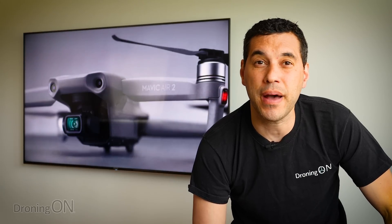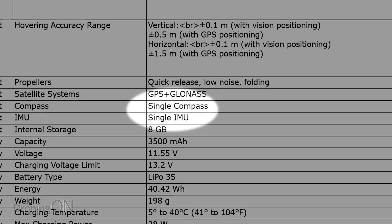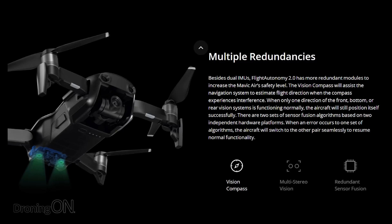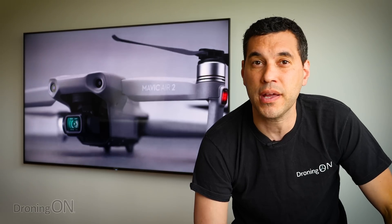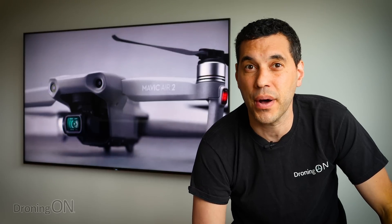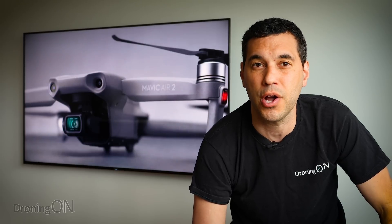The next issue is about sensors. The Mavic Air 2 only has one IMU and one compass, which is quite a surprise given that the Mavic Pro, the Mavic 2 range, and even the original Mavic Air had redundant IMU and compass. These are central processing units responsible for the drone knowing its whereabouts — its position, location, tilt, yaw, etc. If any of these sensors fail, that's when you end up with a flyaway. Ultimately it comes down to cost, and incorporating redundant sensors means more money. Technology has evolved and these single units are more capable, but I still like the peace of mind of redundancy, and this drone unfortunately doesn't have it.